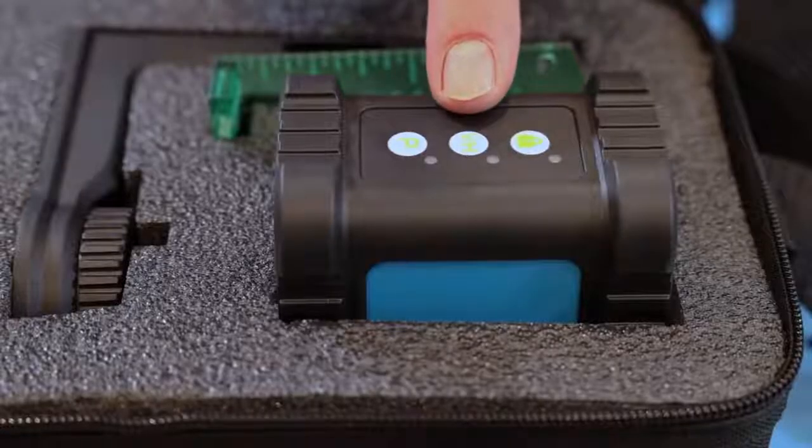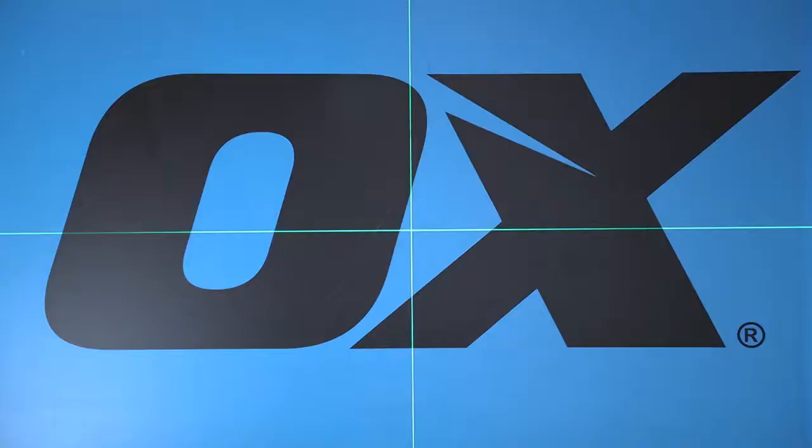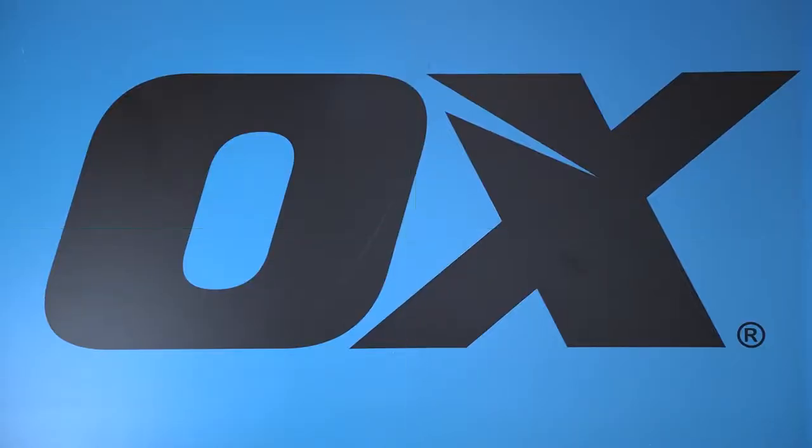The central button has a V and an H marked on it. This is for vertical or horizontal. So I can either press it once for vertical, again for horizontal, and once more, and it will give me a crosshair. The P is to give a pulsating beam, which is useful for when you're finding the beam at the furthest extent of its range.